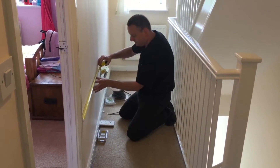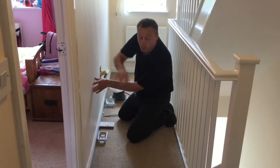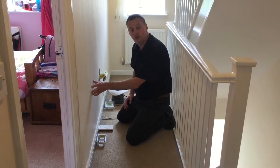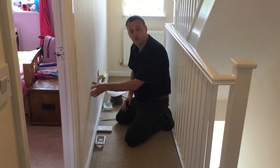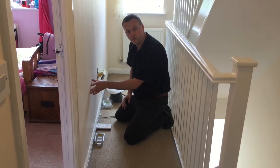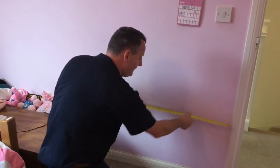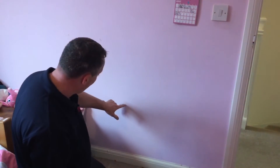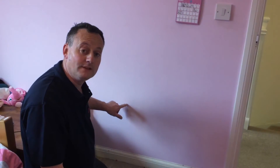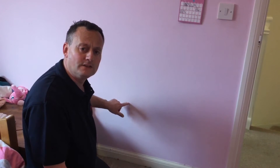The constant being the door frame, and from that side we can see that for me it's about 750mm to the box. The middle of the box should be free from the strut on either side. So it's a safe bet we're going to be in a good area at 750mm from the door frame. The socket outlets in this installation are at a height of 450mm to the bottom, to allow for people of limited reach and comply with the latest standards.